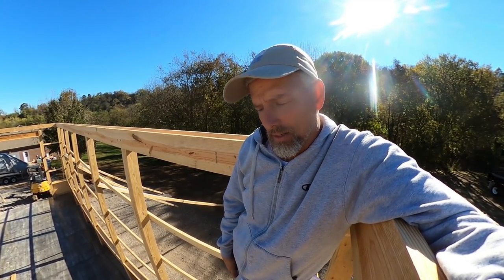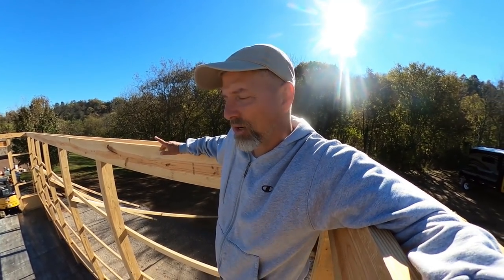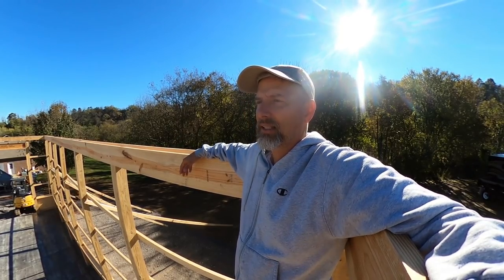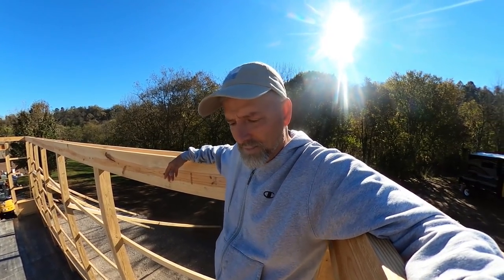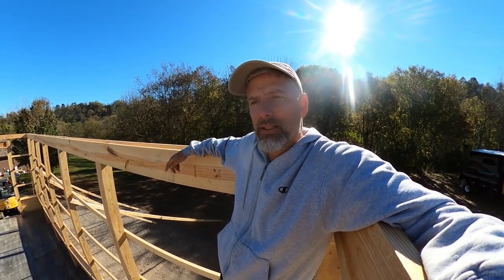So yeah, there's that. Electrical. Really good conversation with the inter-county energy building or electrical inspector. I've heard horror stories of this guy. I called him yesterday morning and said, in Kentucky, I know that the homeowner can do their own electrical, and I'm interested in doing that. How do I go about opening a permit as a homeowner, and what are the inspection cycles? I know there's a service inspection, a rough-in inspection, and a final inspection. And he said, yeah, that's basically the inspection cycle, no worries.